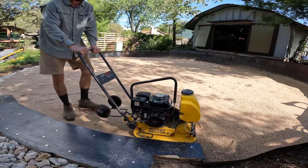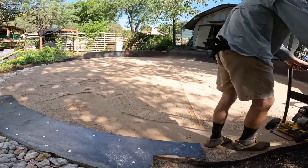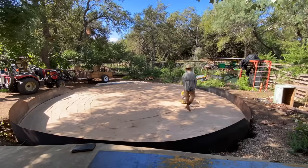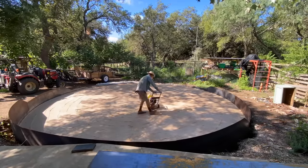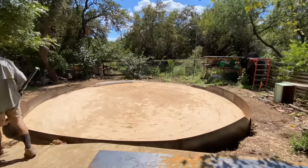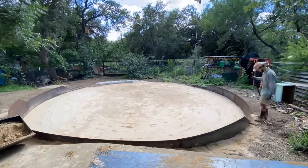When collecting rainwater intended for drinking, the name of the game is keeping the water as clean as possible before it is stored. This avoids the need for excessive treatment or filtration later on. In similar fashion, it is poor form to put any chemicals or toxins into the water on its journey to your tank. This guides most folks to use a metal roof for rainwater collection, since shingled roofs can potentially leach chemicals into the water as it flows down the roof.